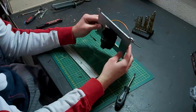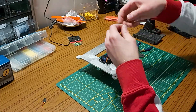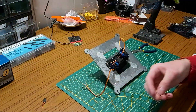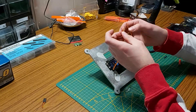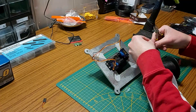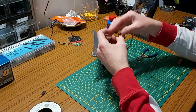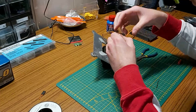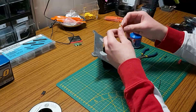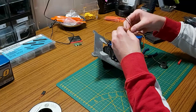So with those parts securely inserted we can start to solder all the wires, starting where we left off with the claw. Since both of the servos are placed mirrored from each other, we can combine the two wires into one swappable port that we can connect to the receiver of the controller directly, to be able to open and close the claw with the switch on the controller.